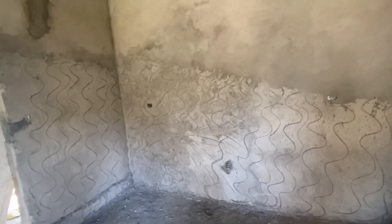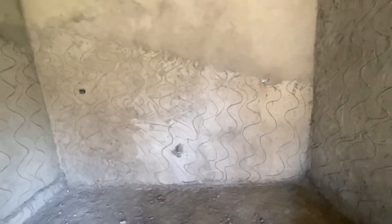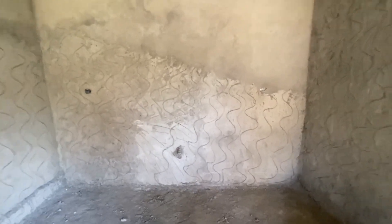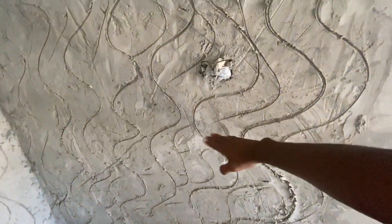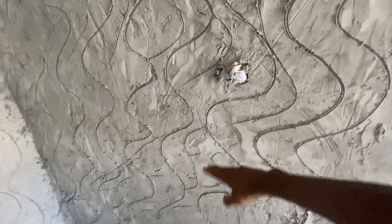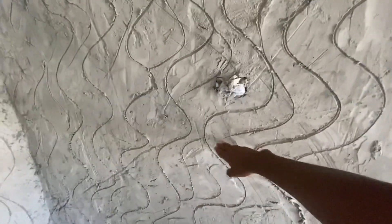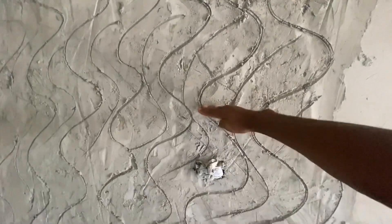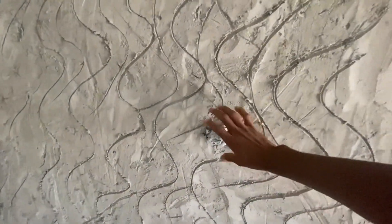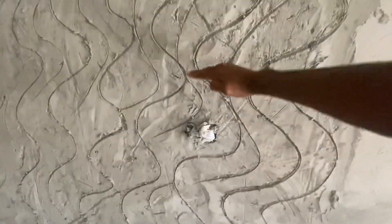This is the kitchen area. The decision we've made here is that the sink or countertop will be about three feet or 36 inches from the floor. So we've placed receptacles right in the middle between the countertop and the cabinet. These receptacles will be used for maybe a microwave, a percolator, and so forth — right in the middle of the countertop and the cabinet. We also have switches here, another switch, and a wall-mounted light.